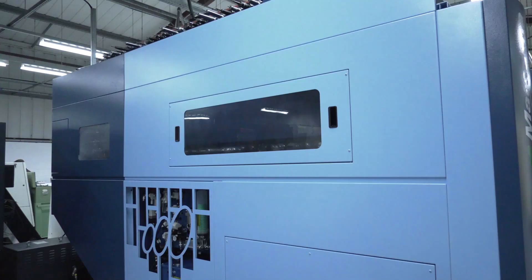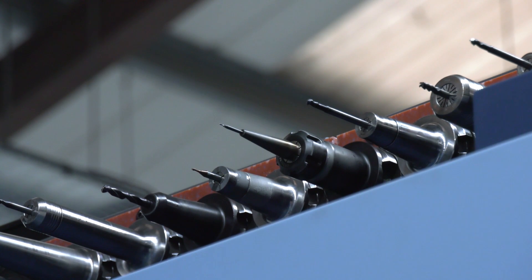You don't really have to think about it. To have sister tooling you need a bigger tool changer — how many tools do you have on this MX330? It has 90 tools in the carousel, which is more than enough for your 10 pallets and your sister tooling as well. So you can be confident that when you press the button, if there is an issue, a sister tool can come in and take over for the remaining components — yeah, it will deal with that, no problem.